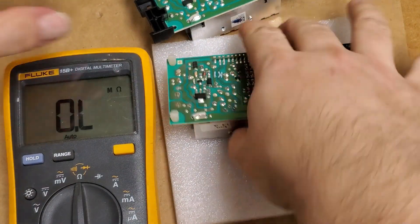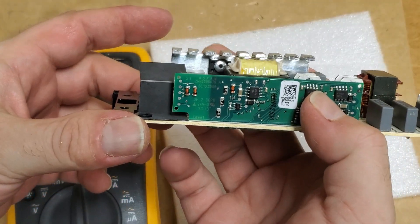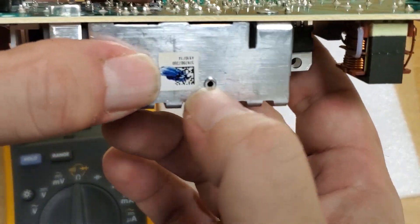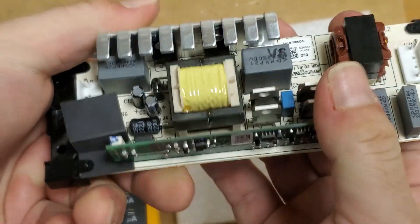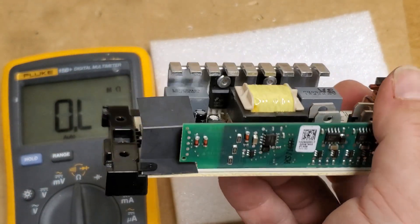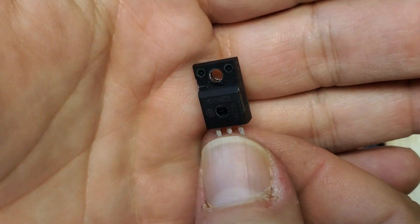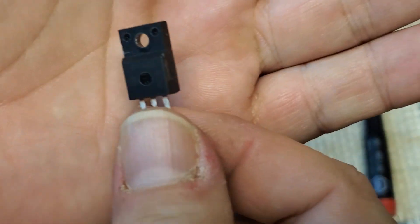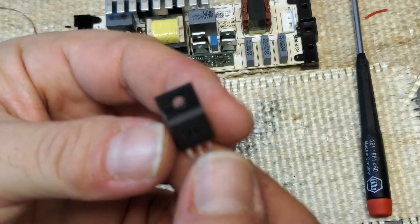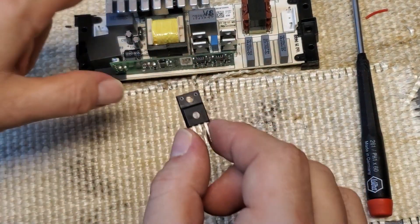So that's no good. It's held in by a rivet, so I'm going to have to drill the back of that rivet out — you can see they stick up a little bit. Then let's reconvene at the soldering iron. Here's the replacement: it is a 6R190C6, a roughly 20-amp, 600-volt MOSFET. We'll use that to replace the bad one.